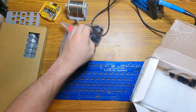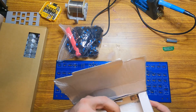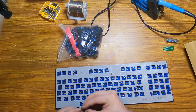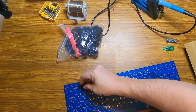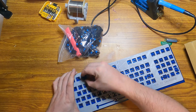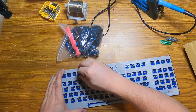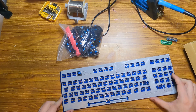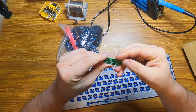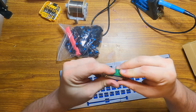I bought a box full of blue MX switches. The seller on AliExpress threw in a bunch of other types of switches in case those didn't work for me. I 3D printed a plate for holding the switches — but I made it a little too thick, about three and a half millimeters. It needs to be about two millimeters, and my 3D printer is out of commission right now, so I'm just going to solder them in and hope everything works. I also designed a set of DB25 to jumper wire adapter boards — these may not be used in the final piece, but they'll help with troubleshooting.